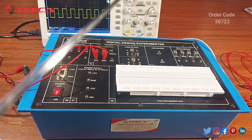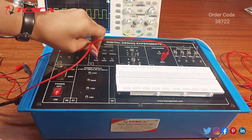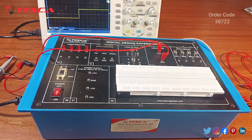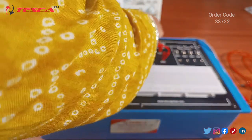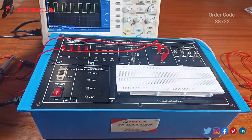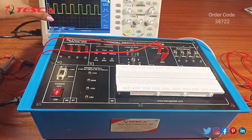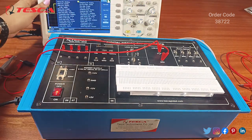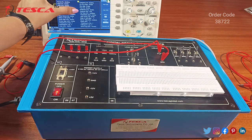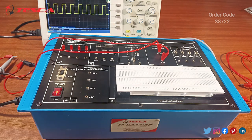Now we will see the line source pulse on the DSO. We connect the ground into the ground section and the main section into the line pulse. We then auto-set and here you can see the line pulse shown. You can adjust its amplitude. By using channel 1, the position button lets you adjust position left-right and up-down. From the measure section you can check all characteristics — period, amplitude, frequency, maximum, and other properties of this wave.